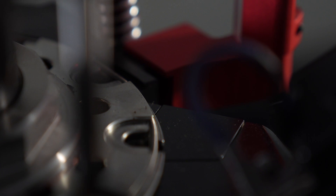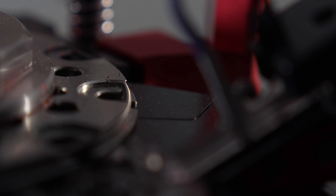Next we have our primer orientation sensor. The Mark 7 primer orientation sensor probes every primer pocket in the station after primer insertion. It's sensitive enough to detect an upside down primer, a primer too deep, too shallow, or not present at all.